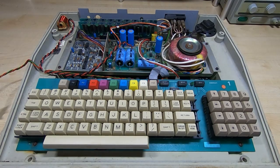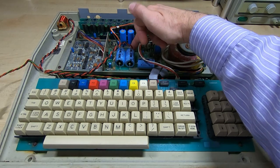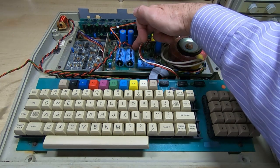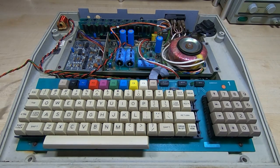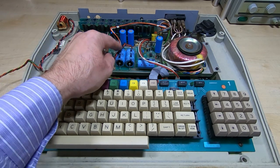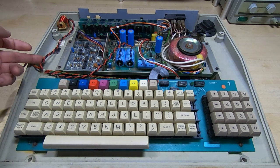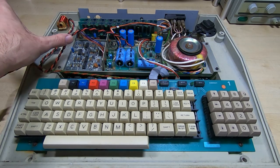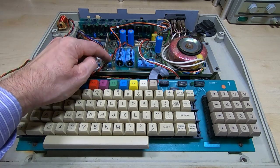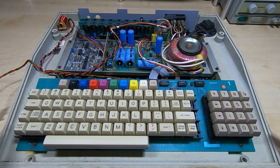The only thing that's a bit unusual is the inductor over here. It looks like there is a place for it on the PCB, so quite why it's not there is a bit strange. There's nothing I can see in terms of space to prevent it from being there. Whether this was a repair at some point - it doesn't appear to be, it looks like it's original. It's obviously there for some kind of filtering purpose, but putting an inductor on the end of an 18-inch long lead does tend to defeat the point of it to a certain extent.